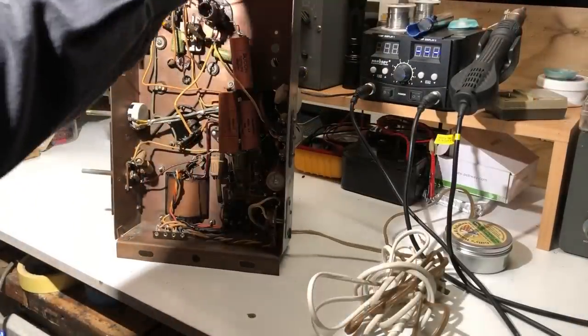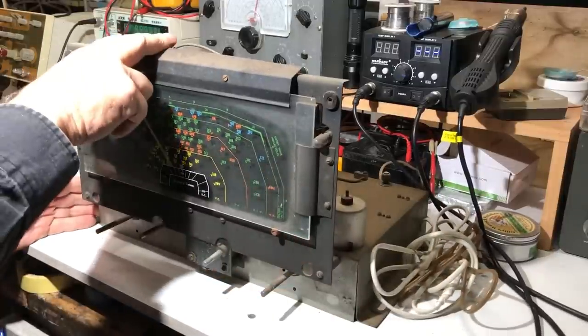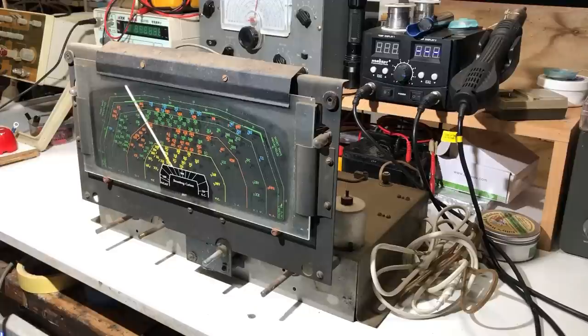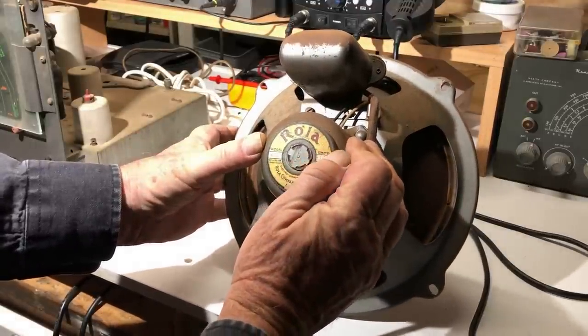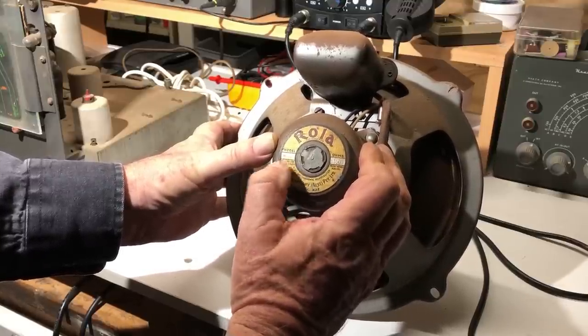Tipping it back the right way up. I'll have to take the dial face off to get at the drive — and I can move the capacitor independently, so that's good. I half expect it might work if I power it up, but first I want to check the transformer, and secondly I'll need the speaker in it because the field coil operates as the choke for the power supply. Here we have the speaker — I think that reads 1000 ohms for the field coil impedance, model E10 or F10.